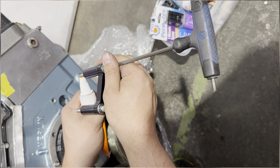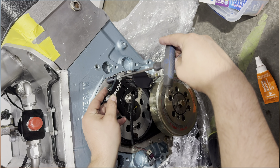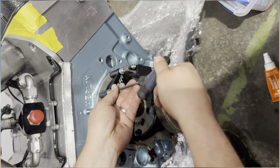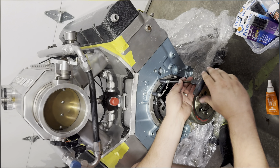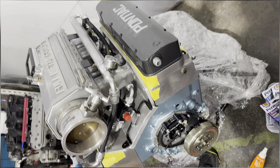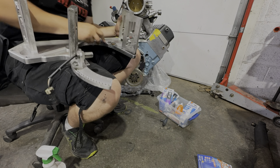We've got some Permatex things to do first. I'm actually testing out their orange thread locker. Something I really like about it — it's kind of a hybrid, like a blue Loctite, but it's a gel after it hardens up. When you go to take it apart it's real easy to clean the threads off; the gel just crumbles right off versus blue thread locker, which gets really hard and crusty and sometimes you have to take a wire brush to it. If you just need something with good resistance, this orange works really well.